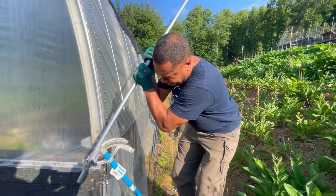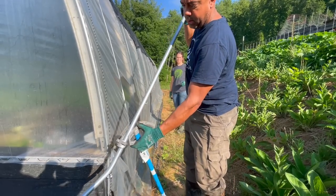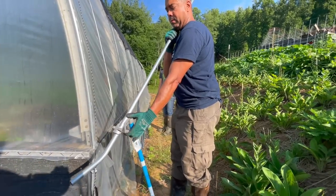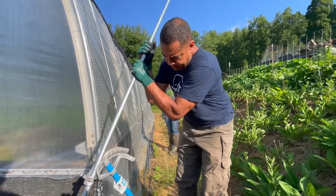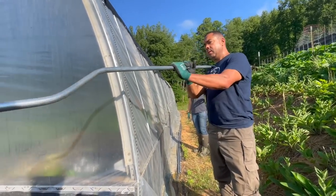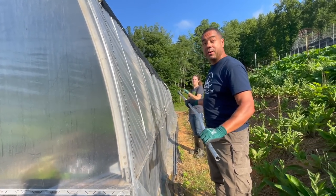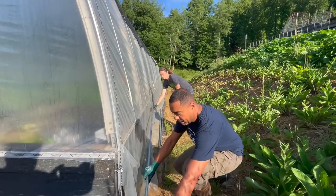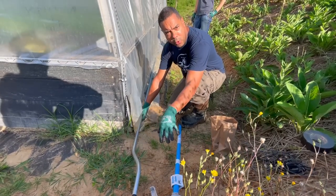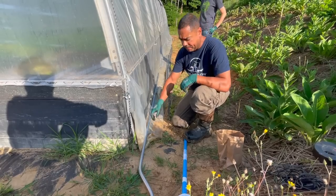This thing has degrees on the side of it. Now what I could do is sit here and do a back-to-back 90 and make a right-angle, a 90-degree angle, and then another 90. But I'm not going to do that — I'm going to do 30 degrees because of how low this thing is going to be sitting to the ground. If I have a back-to-back 90 it's going to be tough to try to roll this thing up. So I'm going to do about a 30-degree bend and offset this thing. I'll use the calibrated eyeball.